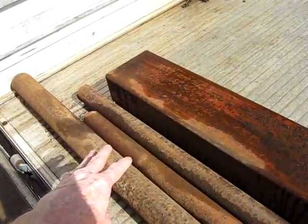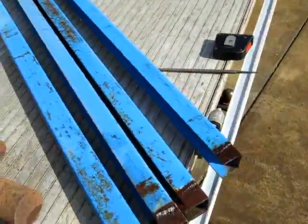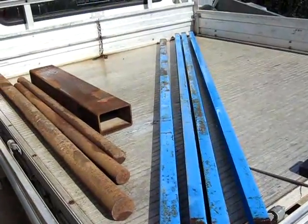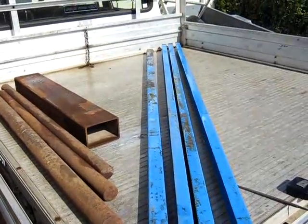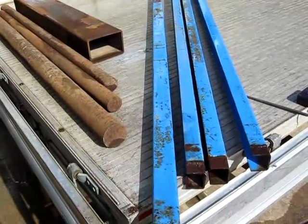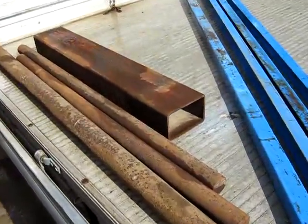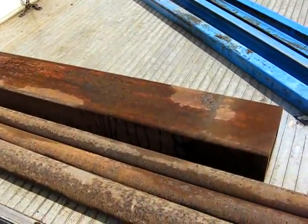While I was at the yard I also picked up some 3mm thick U-section — this is rolled steel, so that'll be good for the legs, cross sides, and bracing. I'll make the stand base out of this, then the spine will go across the top, and hey presto — after a bit of welding, instant lathe stand.